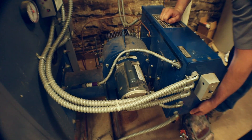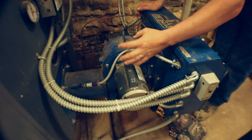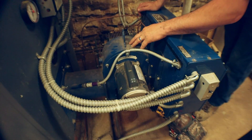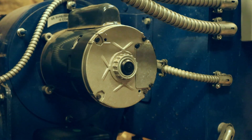So here's what we have going on. Here's our burner motor right here. It attaches to a squirrel cage that sits in there. The UV sensor has to come off right here — we unbolt this, the whole assembly slides out, we put the new motor and squirrel cage on. It should be pretty simple. First things first, we need to unwire this thing, but we do have to check the power. Keep in mind when you unwire something like this — this is a dual voltage single phase motor, either 115 volt or 230 volt. We just have to be aware of what wires go where.